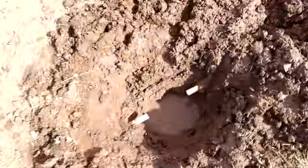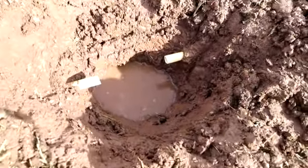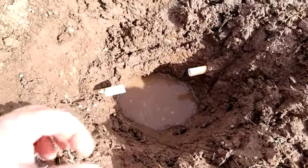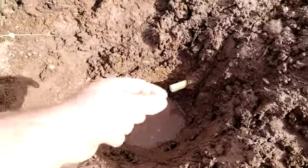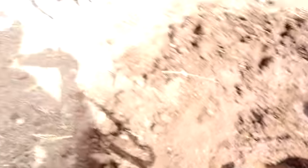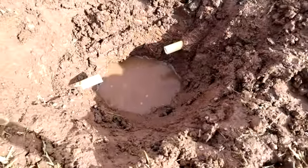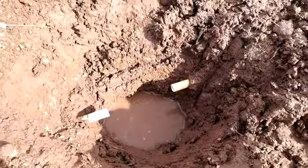I've cut out the old piece — I'll show you that in a second — and I've taken some plumber's emery cloth tape and roughed up the edges here. I brought some clean water out in a two-liter bottle and just cleaned up these fitting junctions.